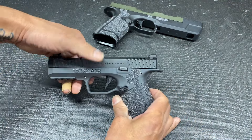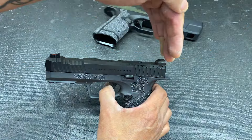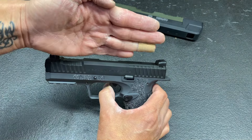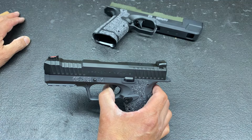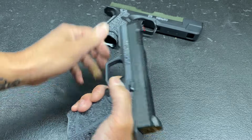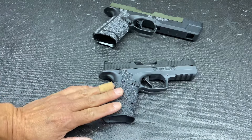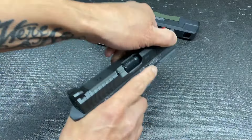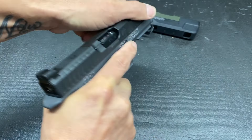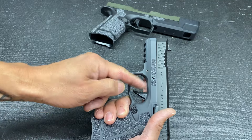So how do we achieve this? There's geometry in this part of the gun. When the trigger is pressed, we want the sear to move to the side and time it so that when the trigger presses into the trigger plunger — the detent — that stops at the same time the sear is in the right position for the striker to go. And on the flip side, when you're doing your trigger reset, there is less distance for the reset as well. That is an awesome trigger, and that's why we're doing this for all the guns we're doing trigger jobs on — because it's a great, flat-shooting gun. With the low bore axis and the inline barrel and all this cool technology, you're going to be back on target faster for your split times. So now you really have a great trigger to lend to the shorter split times and the less trigger movement.